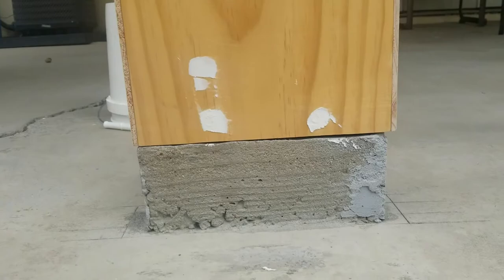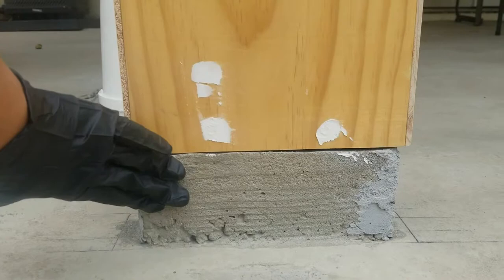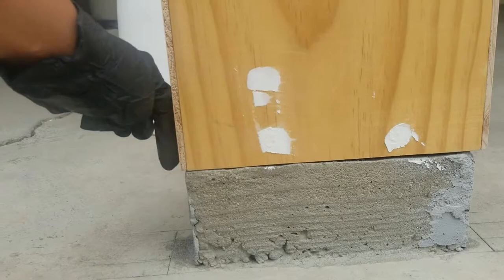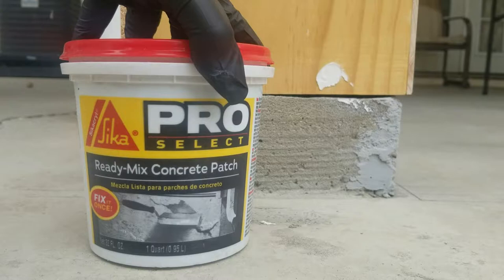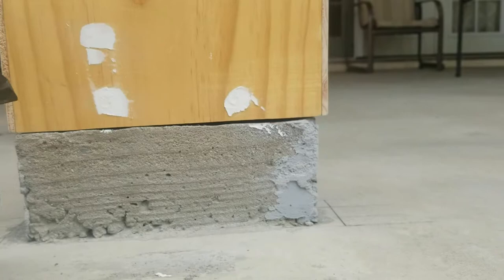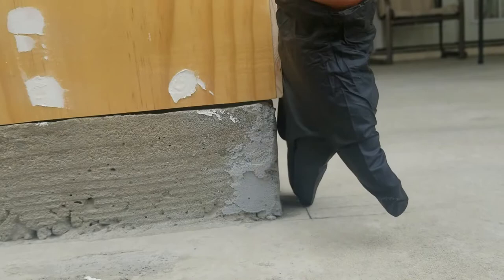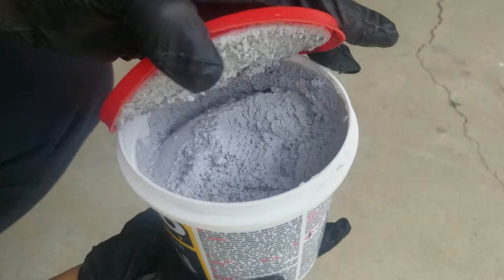Before putting the boards on, I had to make a concrete base using a frame of two-by-fours. However, I did not account for the thickness of the side boards — I only accounted for the front board length. To fix that error, I'm going to use ready mix concrete patch, which I bought from Amazon. I'm going to add just a little bit on each side to make it flush with the wood. I'll add the Amazon link in the description box.